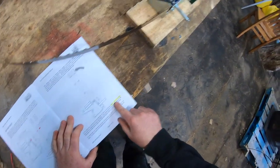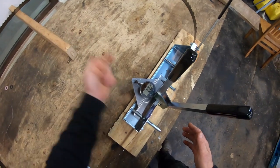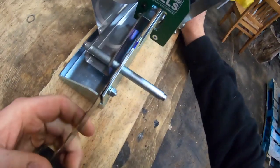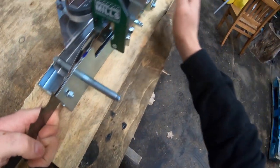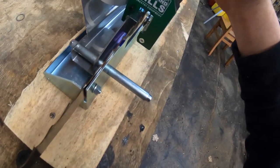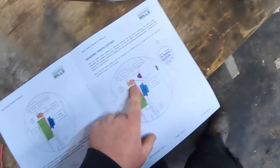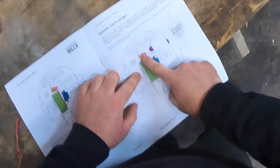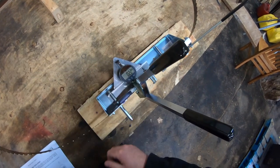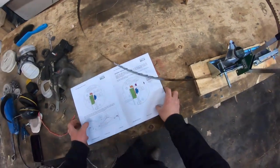I'm going to show you how it works. It's very important that when this is pointing that way, that's the set you're going to be putting on the tooth. Very important you remember that and check which tooth is going to be in position, making sure the teeth that go that way is the first tooth you're setting. What you're going to do is use the handle — that set screw will contact the top of the tooth shown there in red, then press against the indicator plunger, which is directly connected to this digital readout. That's going to tell me what to settle the teeth to.